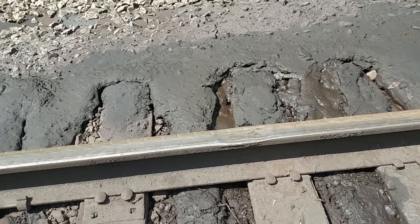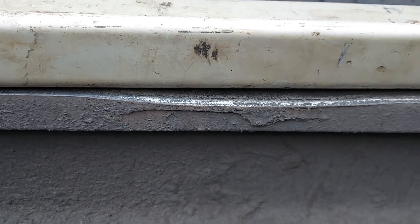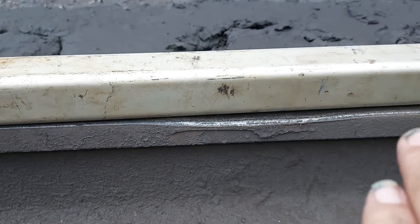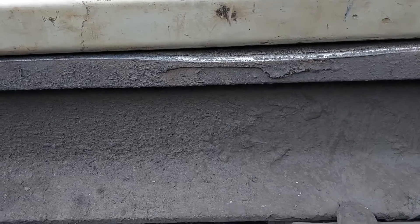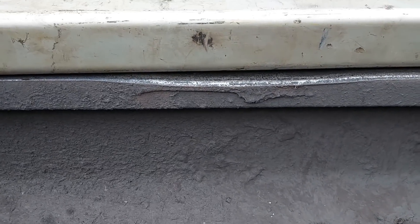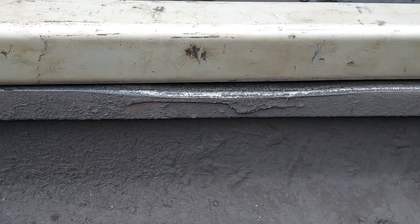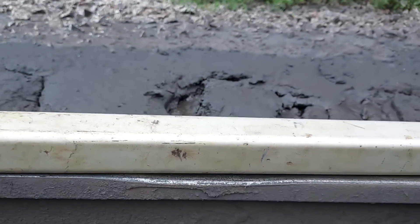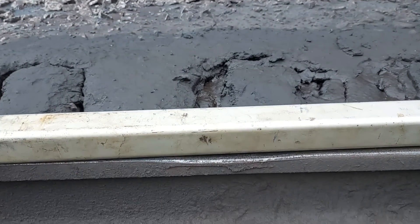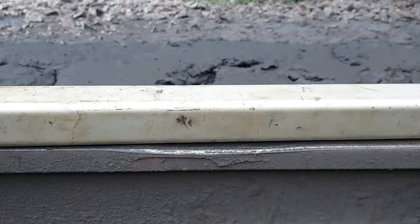Let me see if I can find something to show you that a little better. We got a little bit of a straight edge on there and you can see how it's dipped in there. This very well could have originally started with a small mill defect — an impurity in the rail head from the mill. And because this had sunk down, the pounding of the train wheels has made that come out, and it's going to get progressively worse.